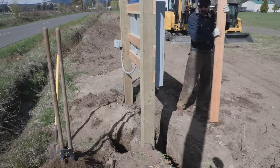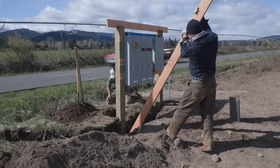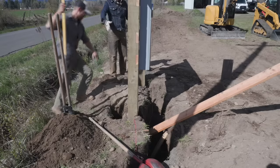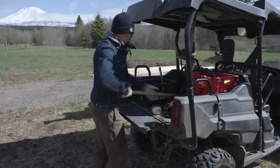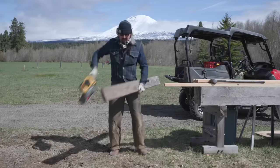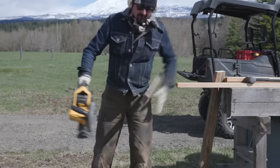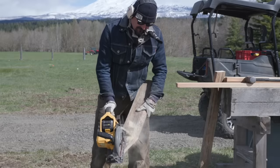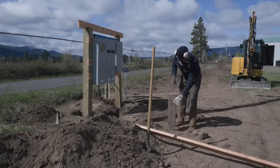He's got it dug out behind and we're going to use this big lever and see if we can work that over. This is not twisting, so if we dig around it just like we did there, it'll twist and then we can put it in place. While he's doing that, I'm going to make a stake and put a leg on it so it doesn't fall over. I've got this old scabby two-by-six we can chop up. We'll put this stake in the ground and then put a kicker off that leg to hold it up so we don't lose everything.